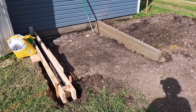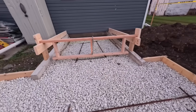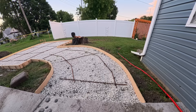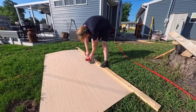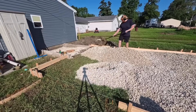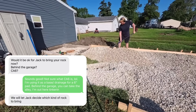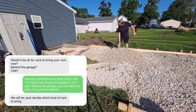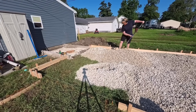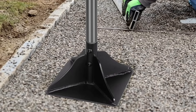This also allows me to pour the concrete floor as an incline to easily transition from one building to the other. I'm also creating a curved sidewalk leading up to the entrance. For this, I am slicing a quarter-inch sheet of luan board. Your local concrete establishment should be able to bring you gravel — make sure you tell them it is for a slab foundation, as there are different grades of gravel. I ordered one and a half bucket loads — whether your bucket will be the same size is a mystery.